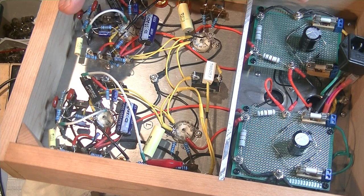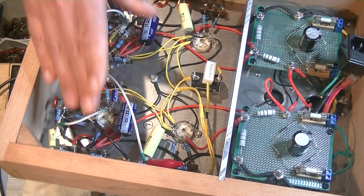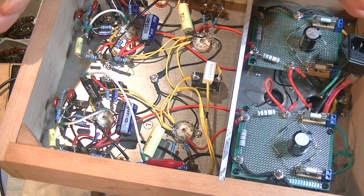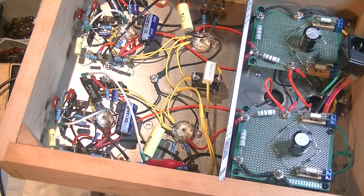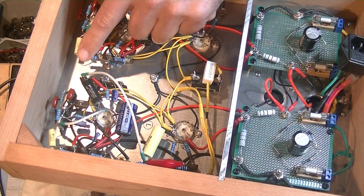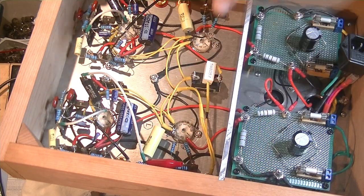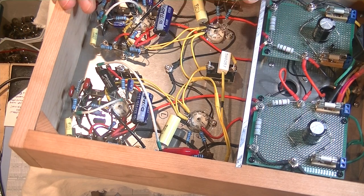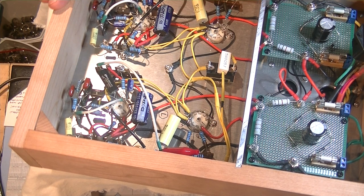But I had a lot of problems with high frequency distortion, and I just couldn't get that cathode follower circuit to work. So I went to a more conventional circuit, and it worked perfectly, and it took all the sparkle out. It even killed the soundstage, it deadened the bass. So after a lot of fooling around, I did an experiment, and I actually just jumped from the last output stage straight to the RCA out, and I bypassed the cathode follower. You can see that little jumper in there. It's got its own problems, and we're tweaking it right now.